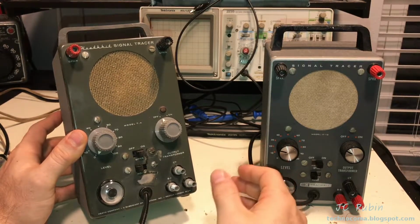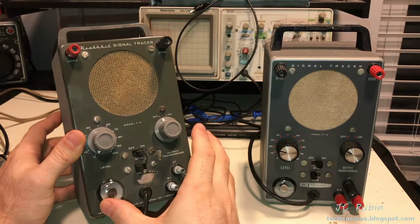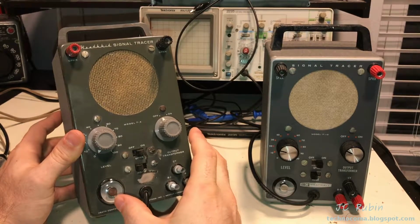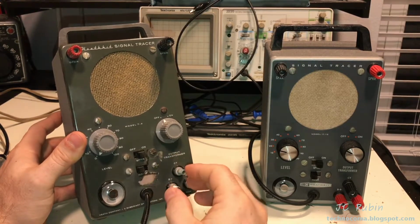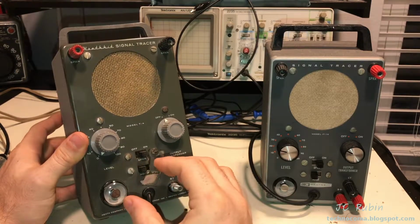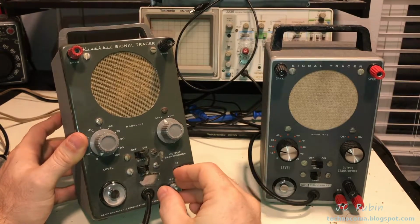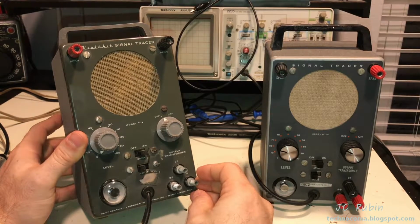These are the things I'm thinking about. But to dial it back, the original implementation is going to be basically ripping out the first stage, because the first stage of this has absolutely nothing to do with a guitar amplifier. It's built in an entirely different way, and then get it so that the characteristics of it match in its entirety as close as possible to the Gibsonette.